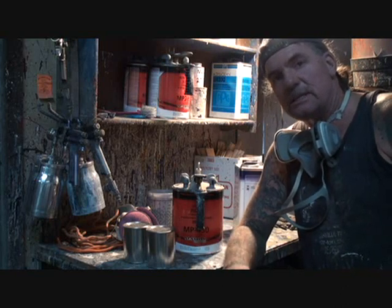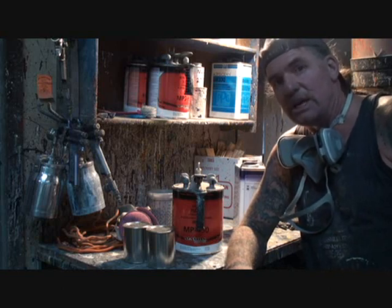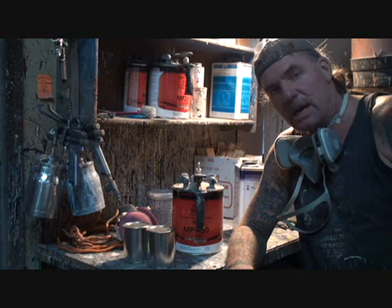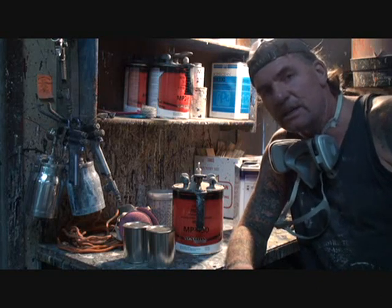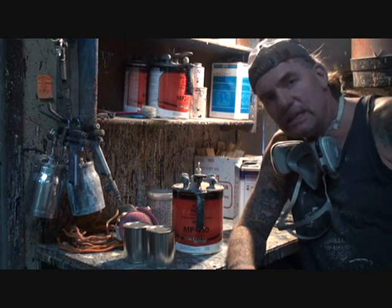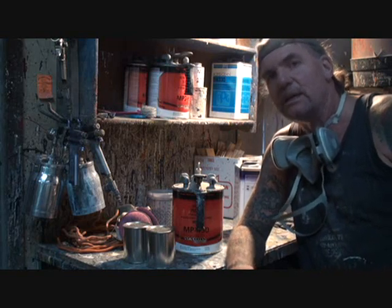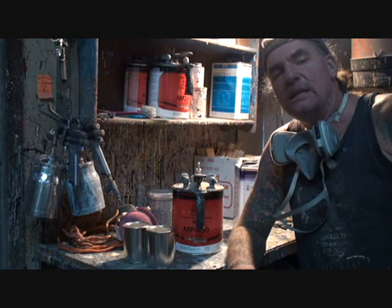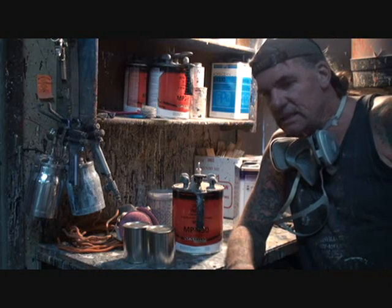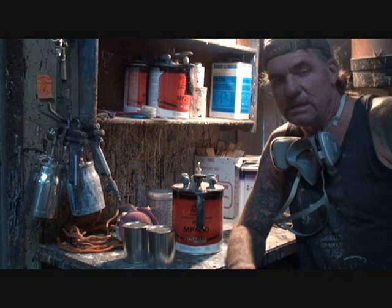You can actually spray this guitar with spray cans. Yes, you can do that. Okay, it's possible if you take your time and you do it right. Before you put paint on your guitar, though, what I'm going to tell you is buy some spray can sealer. Okay, not the clear sealer. Get like some epoxy sealer in a can. Okay, and they sell it at hobby shops, for instance.